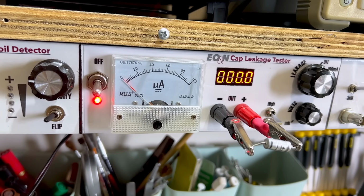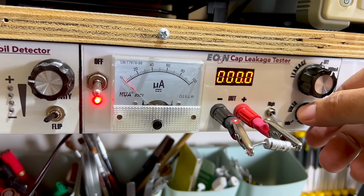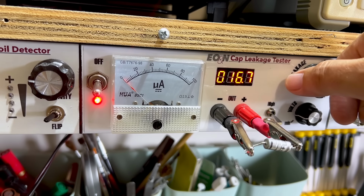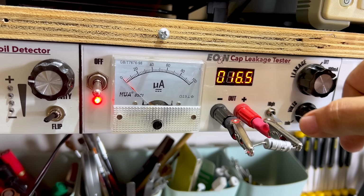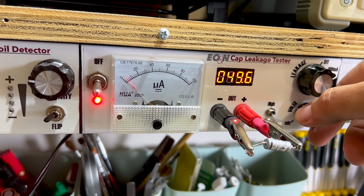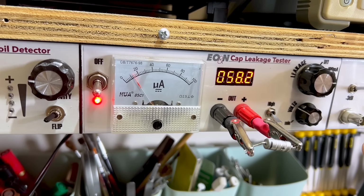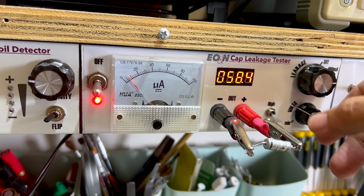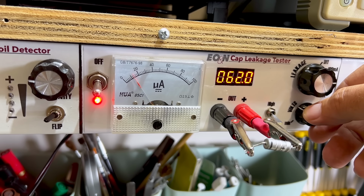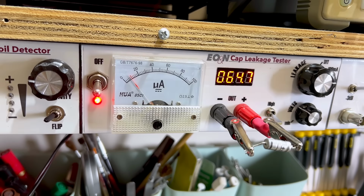This is the 4.7 microfarad discriminator cap. It's 4.7, 70 volts. Let's leave this low and put it on the 100 milliamp scale and go up a bit. Let's leave it there. 10 milliamp scale, it's leaking 1 milliamp. It's coming down a bit, it's sort of reforming, but it's gone. Just going up closer to 70. It'll reform for a while, but it'll still be way over in terms of leakage,